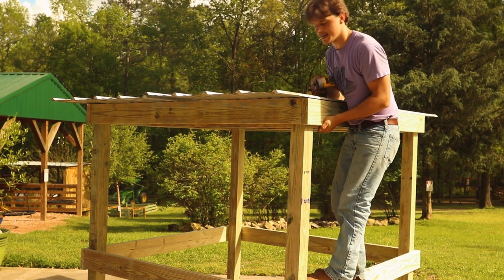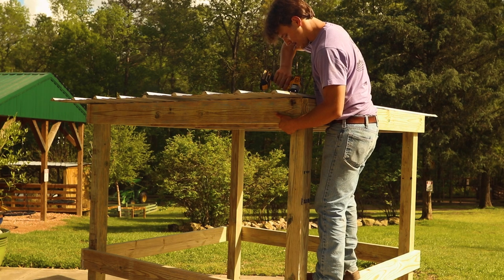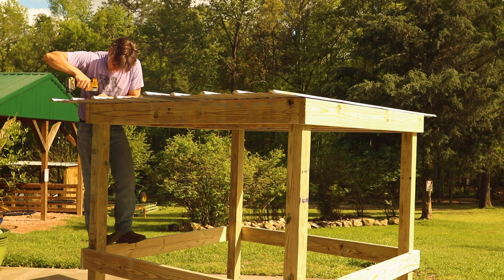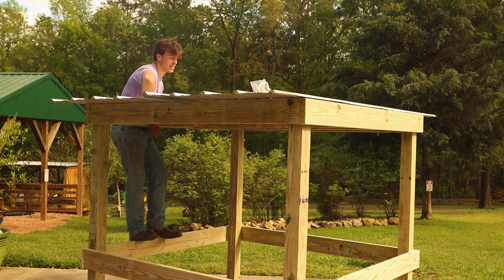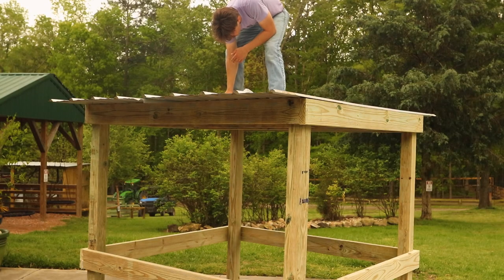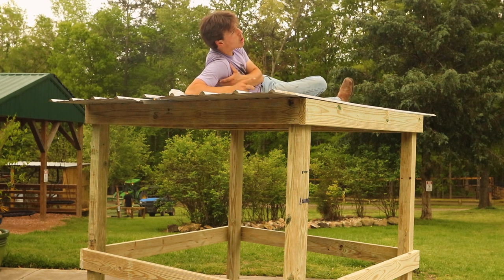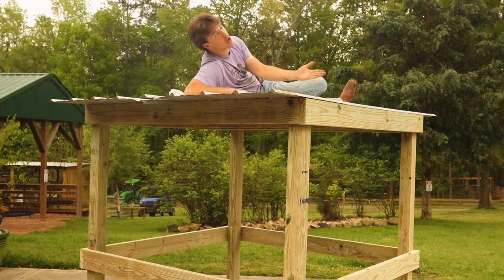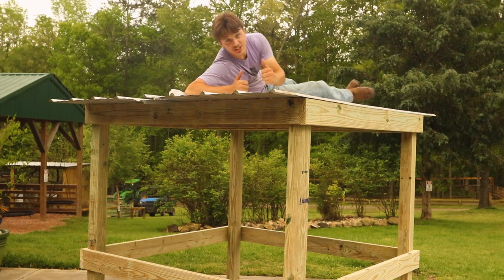Not safe at all, but we got to work with what we've got — and what I don't got is a ladder, so this is getting the job done. We got plenty of screws securing the roof — no rain is getting in here. By far the hardest part of this build is trying to make sure you're hitting the studs. It's so much easier if you have someone underneath. If you can get that first screw right, you can line all your other screws up along with it. I just use the longer roofing screws — that way, if I miss the stud, I still have a lot of wiggle room to try and hit the board.